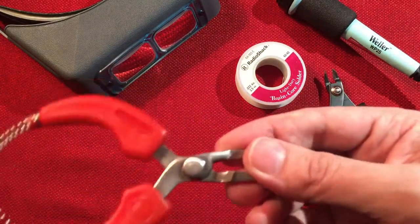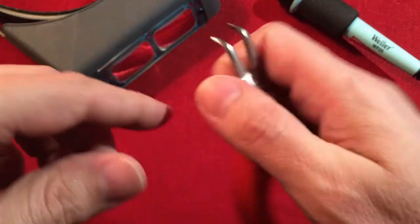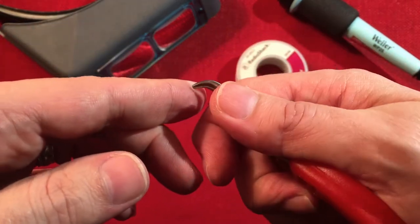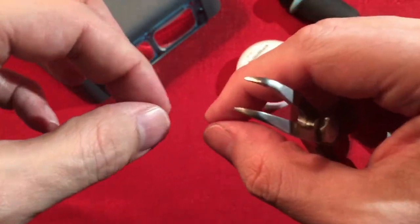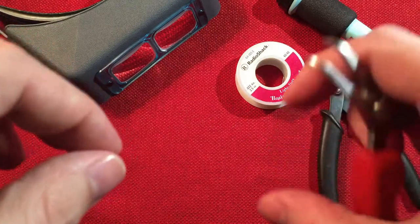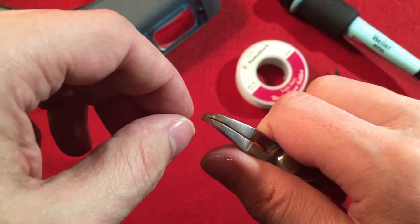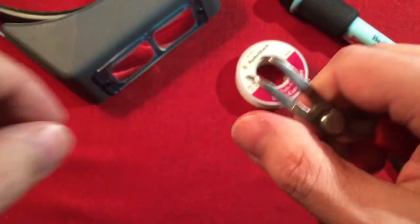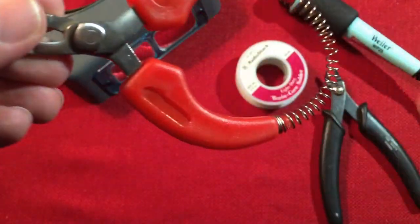I used a pair of curved pliers, like needle nose pliers — used this to turn those little leads. You'll find if you build this kit, the inductor coil was actually kind of difficult. So I had to use this just to bring it a little tighter. Just go gradual, don't go crazy — you don't want to crack or break anything off. I use these to help bend those leads into place so they go through the board properly.